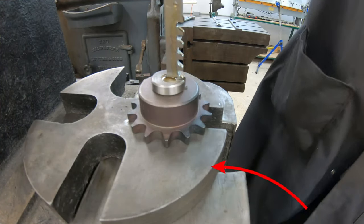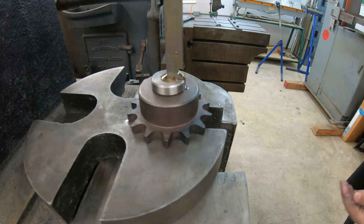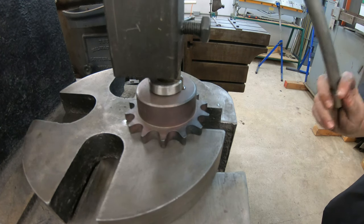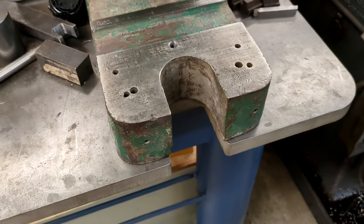Except, what it really needed was a plate. These are what your part actually sits on, and they have a series of slots of different widths cut into them. For when you're pushing something through and out of the part, like a keyway broach, the slots give it a way to fall through, with the different sizes there to support parts of different widths as best as possible. Unfortunately, the plate for my new one had been lost at some point in its previous history — that's part of why it was such a good deal. So, oh no, I was going to have to fabricate an interesting part out of a big lump of steel. How terrible!